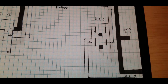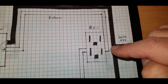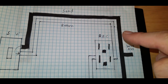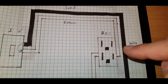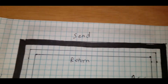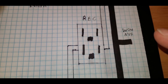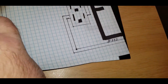This is not the way it has to be. The electrician could very easily have chosen to twist the white wire to the black wire with a wire nut, have the white wire bring power out to the switch, and have it return on the black wire, then feed into the receptacle. So black and white kind of don't matter — one of them is interrupted by the switch but they're both hot wires. You can see I labeled send and return, but it doesn't have to be. A lot of switches don't care which way the current runs through. You may see something on a receptacle where it says line and load — we'll check that on the next schematic.